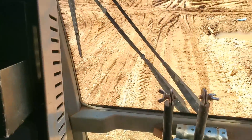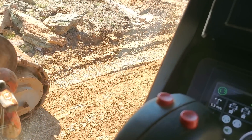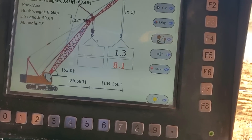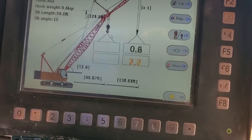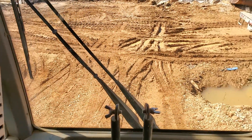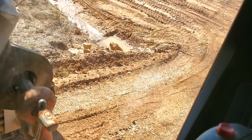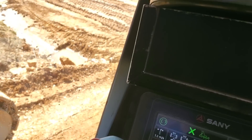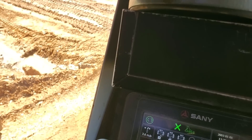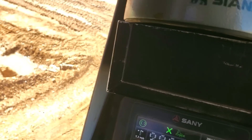The reason why I make this video is because manufacturers are going to tell you you can't do this. They're not going to put this in your load chart. See where my capacity is staying about 8,000 — that's good. Boom angle is staying above 50 degrees — that's good. Manufacturers are going to tell you you can't do this, that you've got to stay on a two-degree slope or less. And I certainly wouldn't want to try and swing when I'm in this kind of position, and I certainly would not want to try and operate, pick a load, or anything like that. But sometimes you need to get on some pretty steep ground to get into position to do your work.